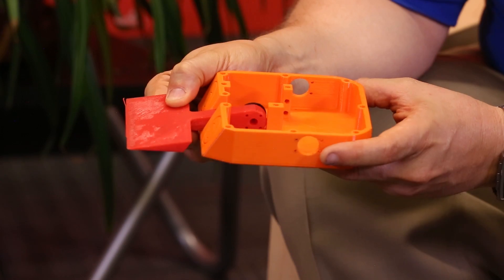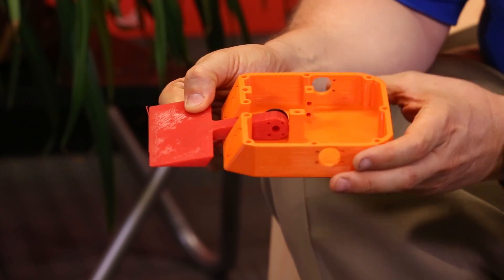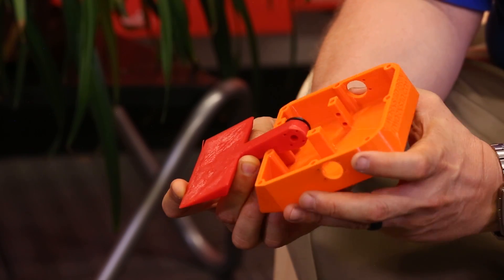I have an early design of a lifter bot that I designed here that had a servo here. I designed it, drove it around, and made a little practice target to drive against. First of all, sorry to interrupt — what's his name? This was an early design originally printed in teal with a green flipper, and one of my boys looked at it and said, 'hey, that looks like Perry.' That was before I added the eyes, so of course I had to put the eyes on to make it look like the Phineas and Ferb character. But the problem with this design is that the pivot for the lifter is right here. Get yourself a little practice dummy — I used a small flat rate box from the postal service and loaded it up with random nuts and bolts until it was one pound. I'd drive against this and try to lift it up. Well, with this design, when it would get under that weight, it would lift the wrong bot. So the lesson is I did that early enough to realize this isn't a good design. I went through a couple of other designs and ended up totally revising it, and that's how I ended up with No Step on Snake.